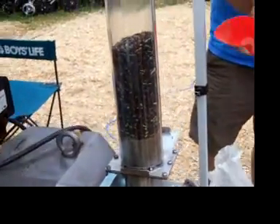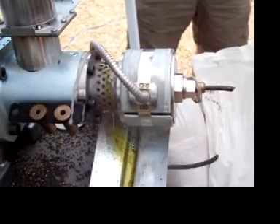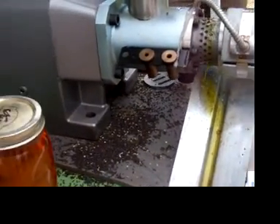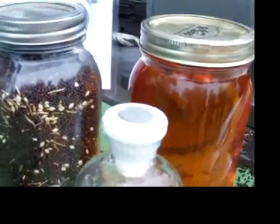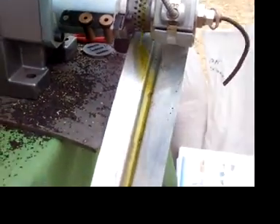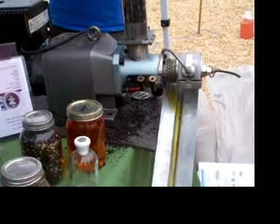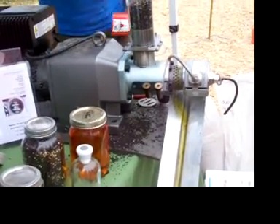Ben Ledoux has got 10 of these presses. He's up by Highway 64, doing non-GMO soybeans, and he's got 10 presses — they run 24-7. He's using flex augers to feed it, with 4 or 5 inch PVC on the flex auger. He's got three sensors; whenever two of the sensors go low, the auger kicks on and fills it up. He's got basically a reservoir of a couple gallons above every press.